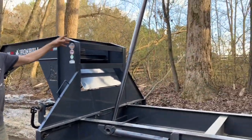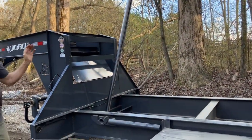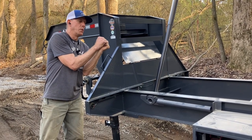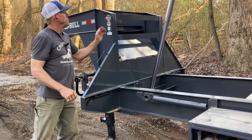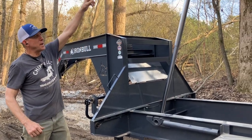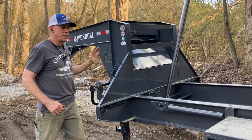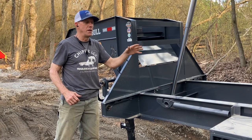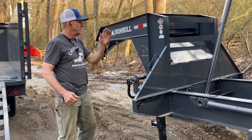You've got a three-stage telescopic hoist up here at the front. The benefit of this telescopic hoist versus a scissor — a scissor is a great system, but underneath it takes a lot of force from back at the midpoint to push this up. By bringing this telescopic cylinder all the way to the front, you're getting a lot of dump angle and you're applying the force to the front. So the dump capacity of this is going to be far beyond even what the actual capacity could be, so there's never going to be a load you put in this that it's not going to dump.